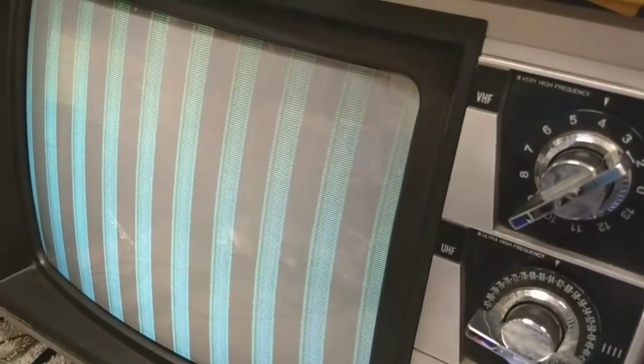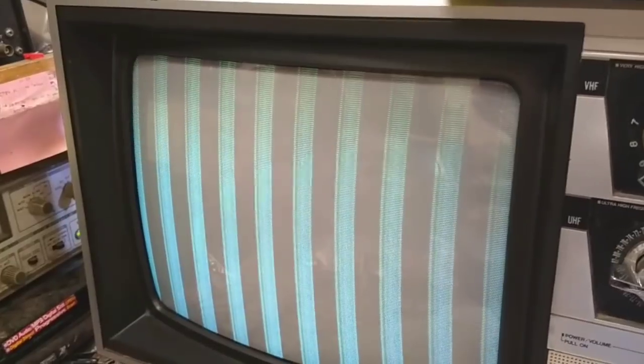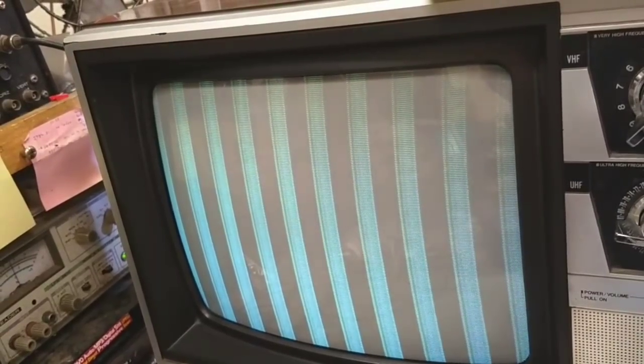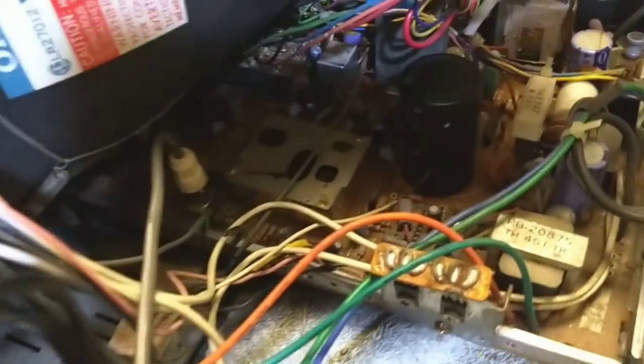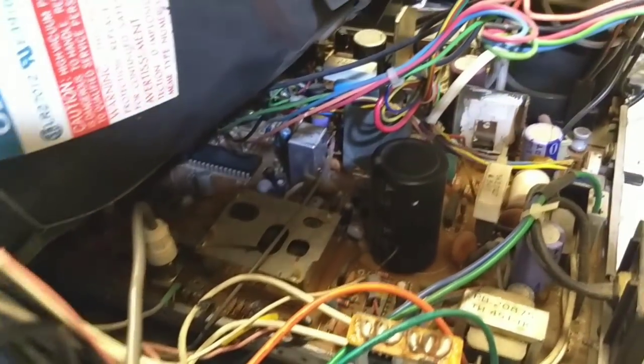It's weird though — how we got this dark area, like there's a power supply problem. I've even exchanged some caps on a preemptive basis, which didn't solve anything, but according to the scope and my meters there's no hum on this thing. It's very strange how it's behaving. And I wish there was a way I could just inject a composite signal to fiddle with that.